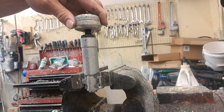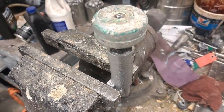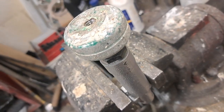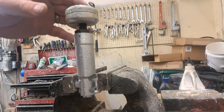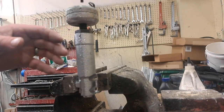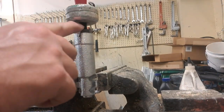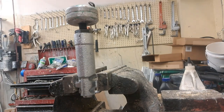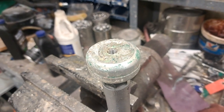I don't mean to make this such a quick video, but this is really something I don't like most people doing because it gets overly complicated and without the right tools it can be difficult. The alternative to this would be leaving it, taking the screw out, and if your pressure is too low, set your Allen wrench inside, loosen this up, then tighten up the set screw on the inside, and once your pressure gets there, tighten this down until it bottoms out, then reinsert the lock set screw on the inside — that'll lock your knob in place. Hope this is a help. If you've got any questions or requests, drop them in the comments and I'll see what I can do to help you out. Thank you.